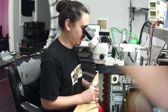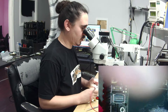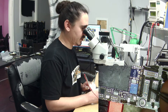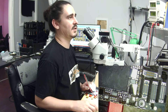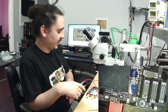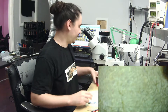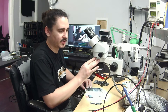So yeah, like I was saying, keep an eye up here — I already did notice a normal boot sequence. Before, we had nothing; it would just kind of spike when I was tapping it. Now when I press it, that 0.07A is like the start of a boot sequence, and once this gets up to around 0.2A I can pretty much say it's booting. It will continue to rise, but that's good enough for me. So this should be booting now. I can grab a battery, screen, and a charge port to confirm.